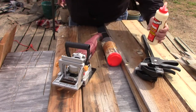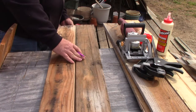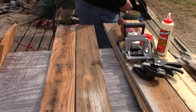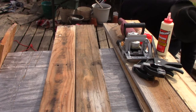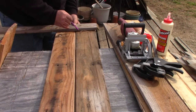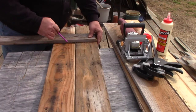And of course you're going to need glue. We line the ends of the boards up. We're going to make marks on these boards to mark where we're going to put the biscuits. To do that, I'm going to need just a straight edge — a straight piece of board will work. I'm going to put five marks across the two boards so that we get the biscuits in the exact same location on both boards. You just want to make sure that that board is straight when you're putting it down to draw the line.